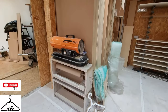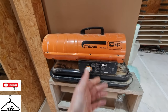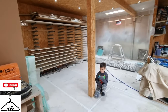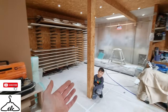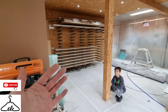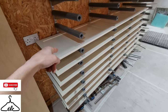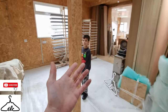Over here we've got a space heater that runs on kerosene. It makes it really warm in here and dries the paint so fast. In summer with the heater on, 20 minutes and you've got a dry door. In cold weather — 8 to 10 degrees outside — give it an hour to an hour and a half, even for drawers or inside shaker panels where paint doesn't dry as fast. The space heater does a fantastic job.